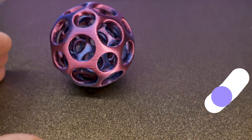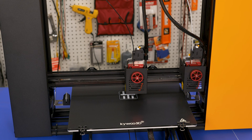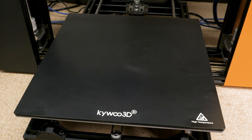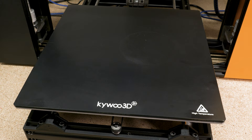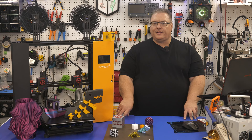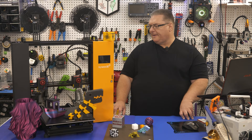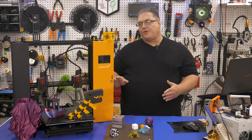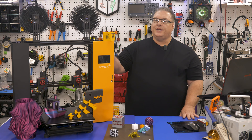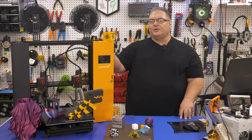Some of my suggestions for KaiWu 3D include adding geared extruders, an all-metal hot end, and changing the motion control system over to linear rails. The build plate was an odd size and I had difficulty finding third-party build surfaces that would fit, ultimately going with the KaiWu 3D option — a more standard size would have been preferable. The version 1 firmware touchscreen interface was a bit confusing, but the version 2 firmware available on their website was much more intuitive, and I imagine new printers are shipping with that update.